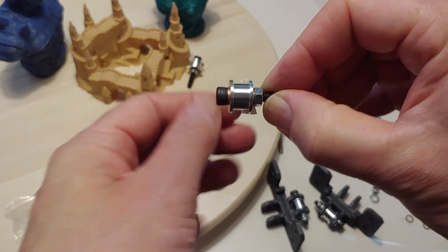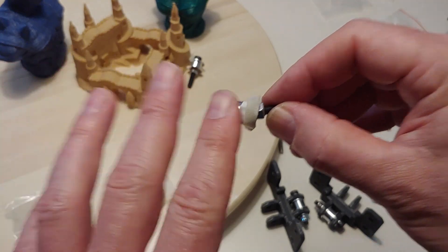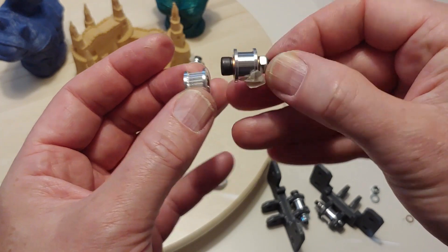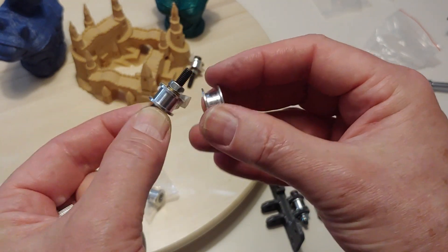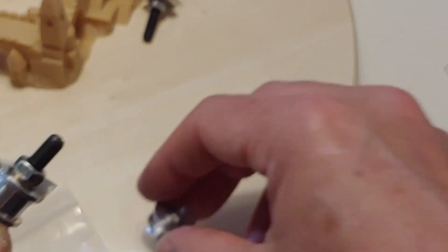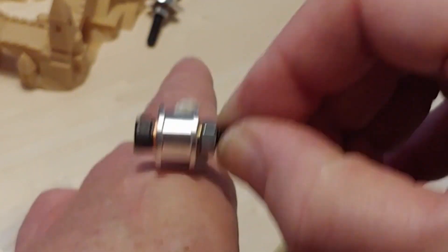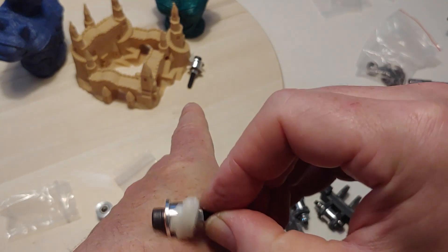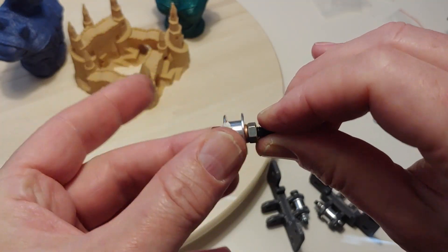You do want to upgrade — this is probably the smoothest upgrade you can do for smooth movement with no restrictions. You need either a toothed or smooth idler depending on the belt side. These quality ones are a slightly higher profile: the cheap ones are 9.5 mm, while the good ones are 10 mm. They also have a smaller diameter, which is really nice for your design. Everyone should upgrade their idlers to ensure smooth movement and avoid stutter and restrictions in the belt path — with the cheap ones I can barely move it even with force.